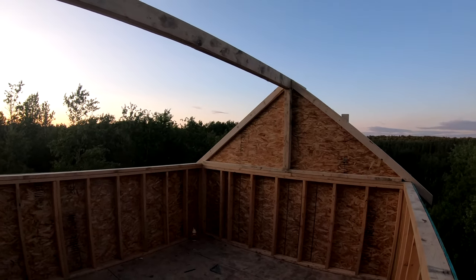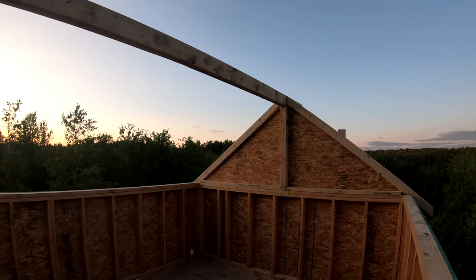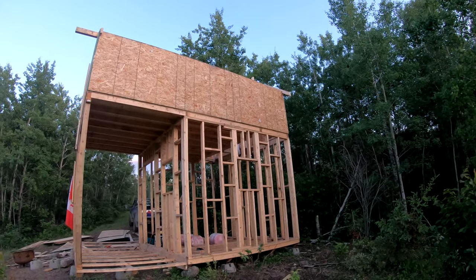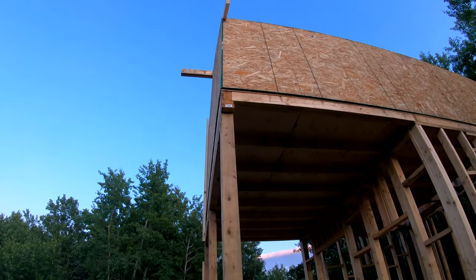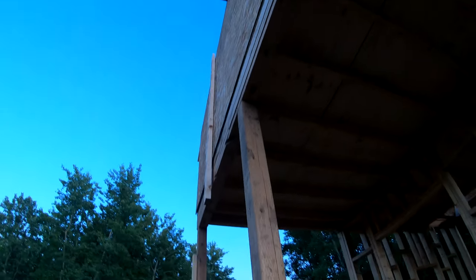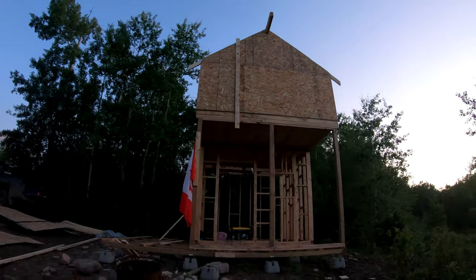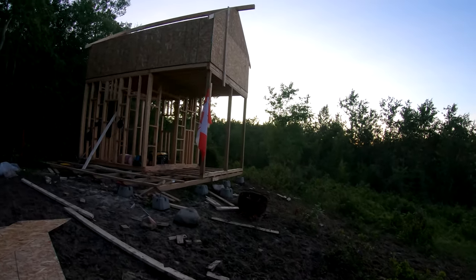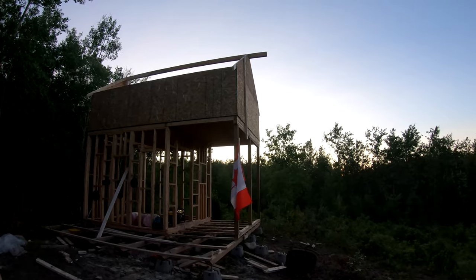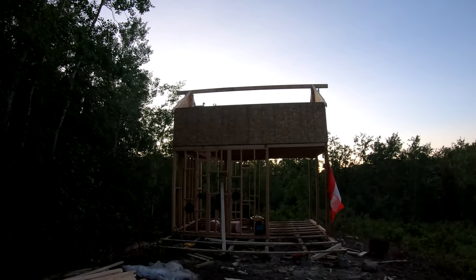I made sure all my walls are getting straight there, and then I bolted the rafters in and tacked the 2x6 to the double 2x4 support. Here's the view from down on the bottom — it is tall as fuck, no doubt. But you can see how mint straight it is — you can kind of eclipse it when you look under it from the bottom. It looks especially ridiculous because we're so downhill here. Curb appeal is the last of my worries — it's more about functionality. You can see my two-foot overhang consistent front and back.